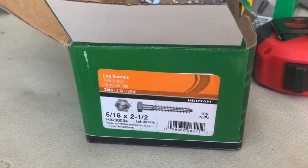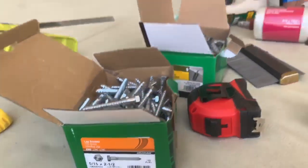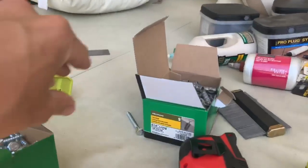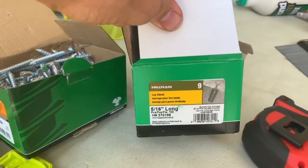Our boards are 5 and a half inches tall. However tall your boards are, you just measure those. I went straight up the wall and every 5 and a half inches I made a tick mark to know the best point to screw in our lag bolts. Here's our 5-foot section — a pressure-treated 2x4 will be lag bolted into the wall right there. I'm not going to show you every single tick mark because that'd be really boring.